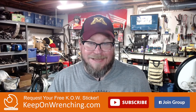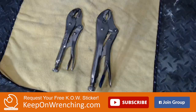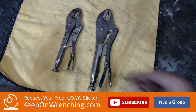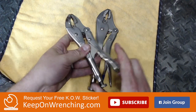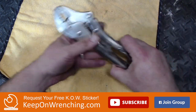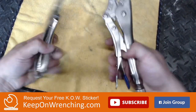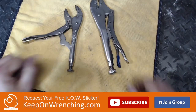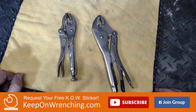This next one is one of my favorites, and I'm always blown away when people don't have a set in their toolbox: vice grips. Vice grips are an incredible tool for when you've already made a mistake. These things will grab onto rounded bolts and stripped-out JIS screws in a lot of cases — really crank down and get the pressure up. I don't know how many times I've had a pair of vice grips on each side, just brute-forcing things off. If you don't have vice grips, what's wrong with you?